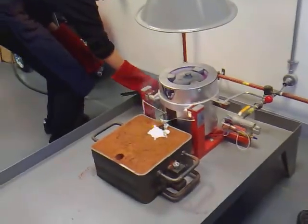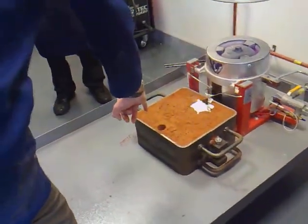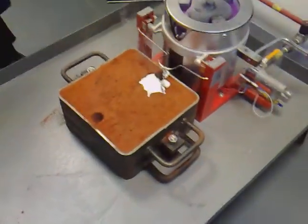We're going to give that another go so we'll get more aluminium in there. It needs to go down — well, it has come through actually, a little bit, so we might be lucky. It needs to go down the riser, into your mould, through the other end and up — sorry, in the runner and out the riser.